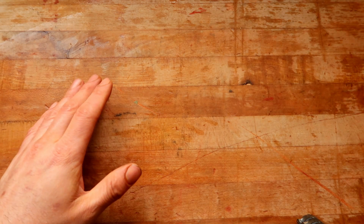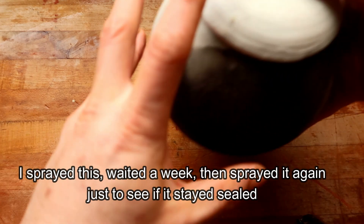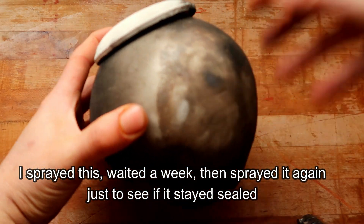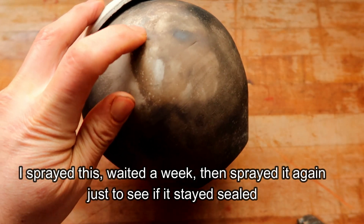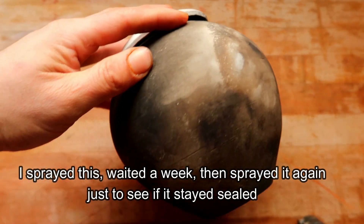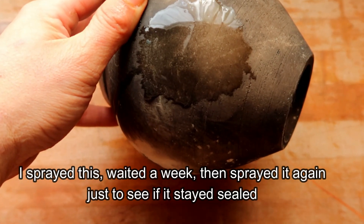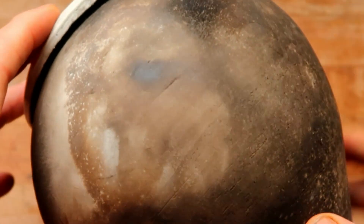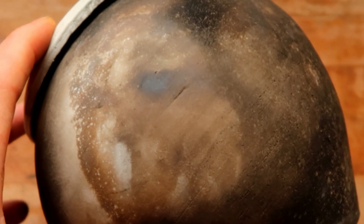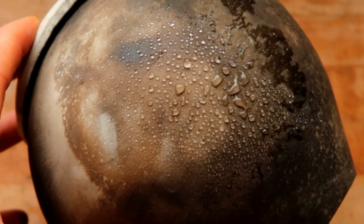I actually didn't believe this at first, so about a month ago I got some pit fire ware and sprayed it on one spot. Left it for a while just to absorb, and then sprayed it again. You see this little spot here is already sprayed with the liquid quartz sealer, although the other spots are not sprayed. So if I spray it over here, it'll most likely absorb really, really quickly. But this spot — the spot that's clearly already sealed right here — if I spray it a second time, it kind of just beads off. It's absorbed as much as it can already. This is essentially how I can tell that it's already sealed.